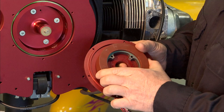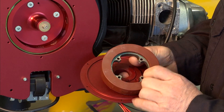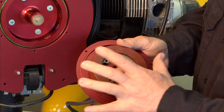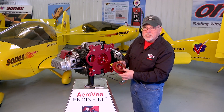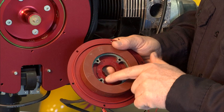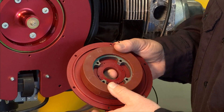What we want to check before going further is how the stator ring itself fits on the backing plate. There are four little mounting lugs on the stator ring that have to fit down over the inner raised boss in the backing plate. We want to make sure it seats down in there properly and doesn't get hung up. Every once in a while you'll find one where the lugs are a little too long — if they don't seat right, just take a file and lightly file them down until the stator seats flat against the backing plate.